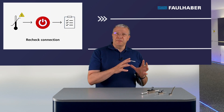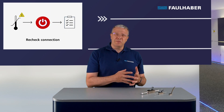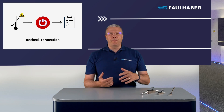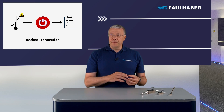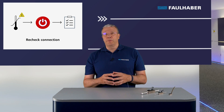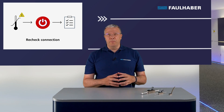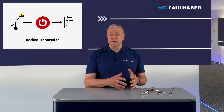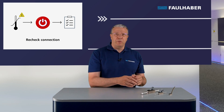Connecting a sensor output to the motor phase of the controller may cause damage due to the high voltage applied on the analog output stage. The inversion of sensor wires, a missing sensor connection, or an inversion of the motor phase connection will cause bad motor control. The motor will become stuck in a position and get hot. In this case, turn off the power and re-check all connections.